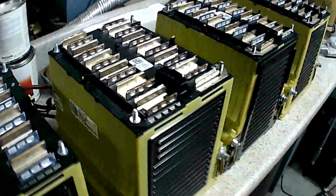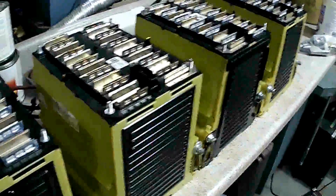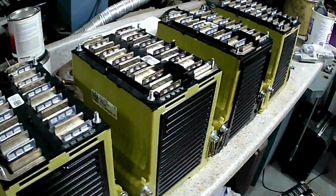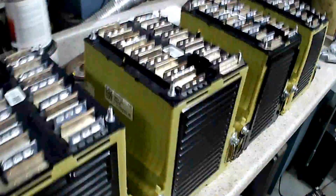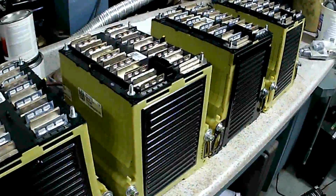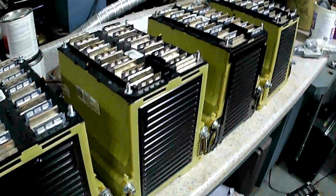Be careful not to touch any metal up here because you've got live voltage right there. I still need to figure out how to cover this in my energy storage configuration — I'll probably make a wood cover, because it's dangerous exposed like that. If something falls on it, it's a dead short, and there's a lot of current. There's two kilowatt-hours in each one of these modules. Alright, that's it — if you have any questions, feel free.